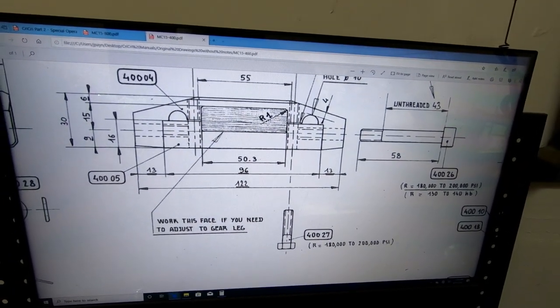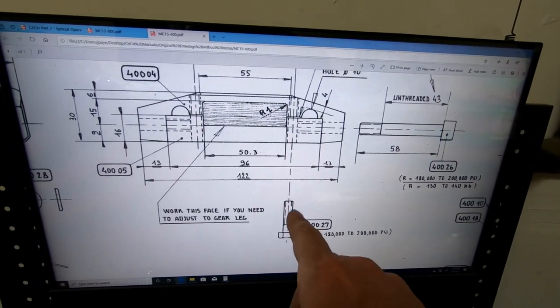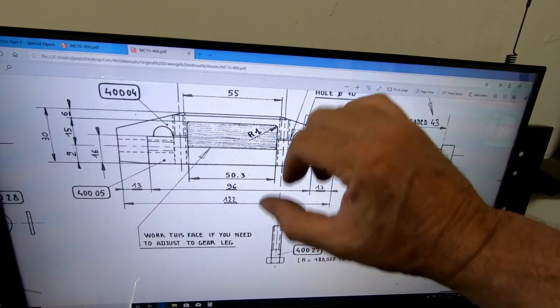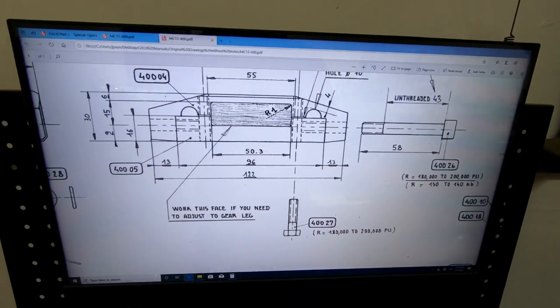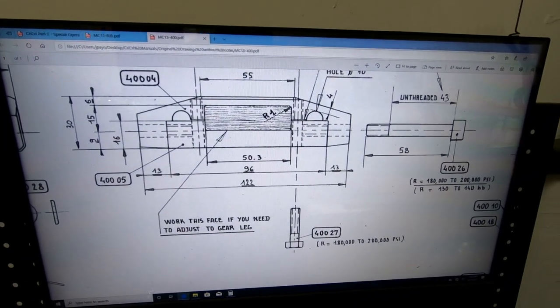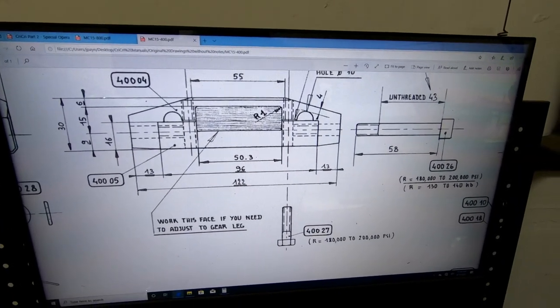So this surprised me a little bit, partly because this is a grade 9 bolt that's steel that's going into an aluminum fitting with threads in it that are only threaded at the top half here, and threads that are that close to this opening here. I'm thinking, how in the world can we require a grade 9 bolt in this situation when, just looking at it, you would think that the threads would strip out of this aluminum fitting long before that bolt